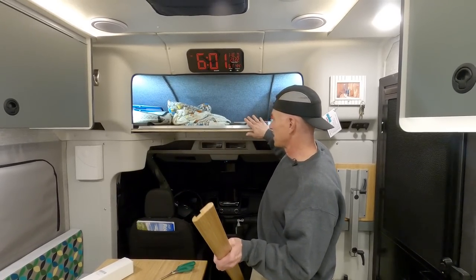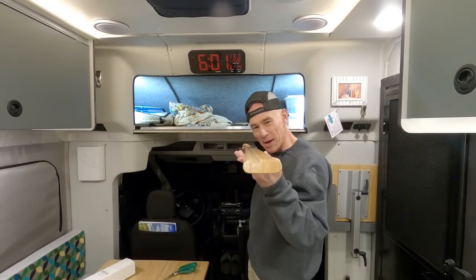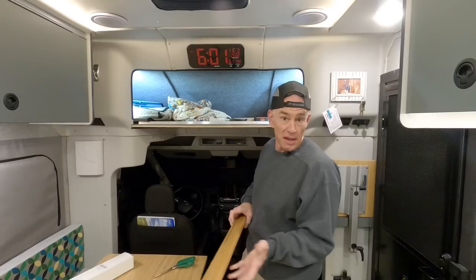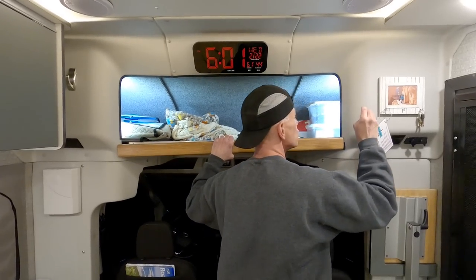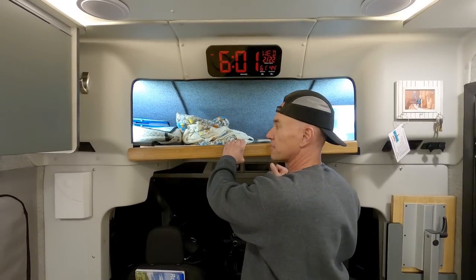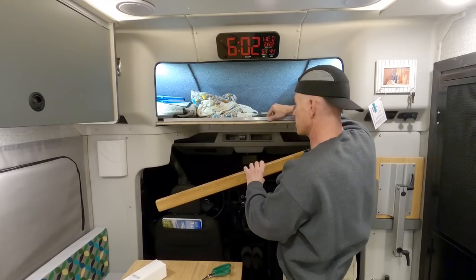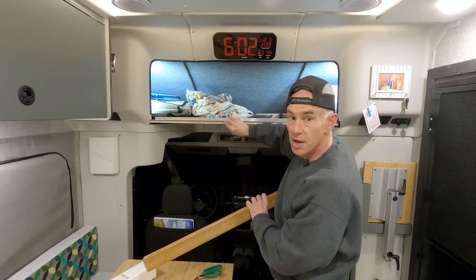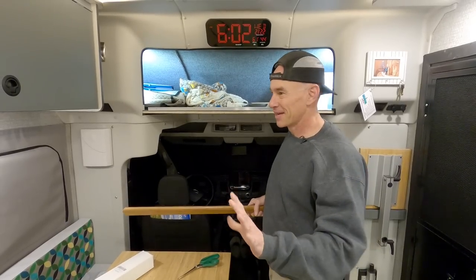We're here to finish trimming this out and getting it ready to go. So I've got this piece of wood. This is sort of the side profile of it. You see it's very well rounded, top and bottom. And then I've cut a dado in here, which will fit over this. I was just going to glue it, which is how I would do a woodworking project. But then I thought, wait a minute. If I glue that in place, I will never again be able to remove these things because it will be blocking them in. And I can't take them to the outside because there's walls there. So I can't glue it, so I'm going to have to fit it over there. And then I've made a big aluminum bracket here that's going to hold it in place and will also be screwed into the underside here. So that's how we're going to get it attached. And then when that's done, we're going to call this project done, but not building.